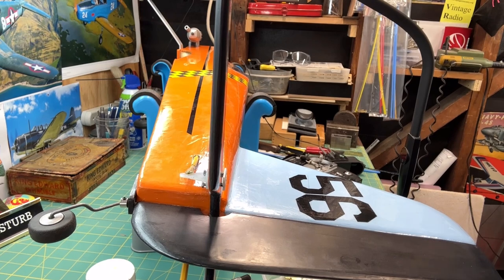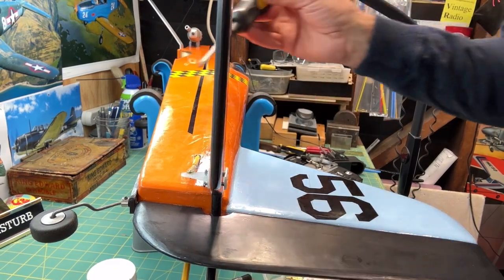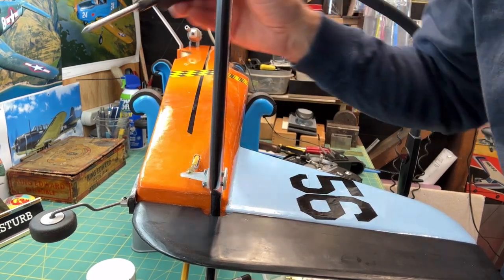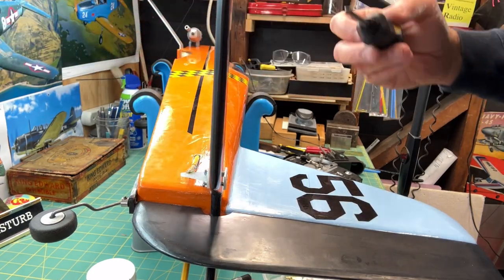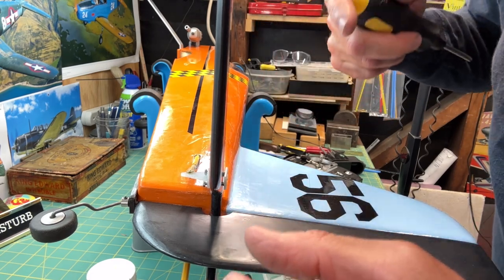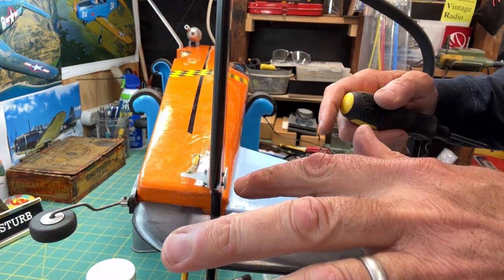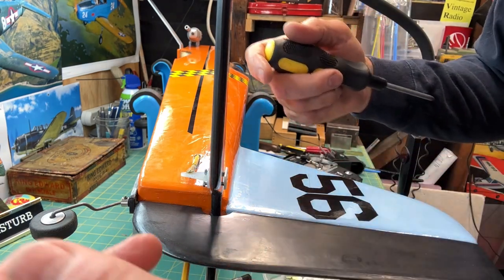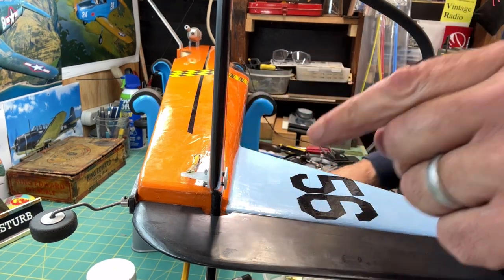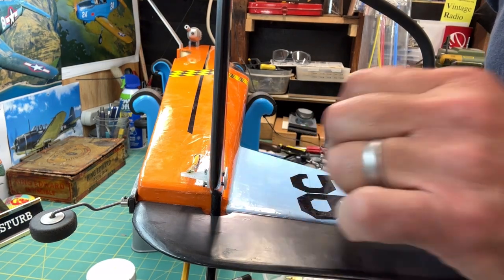All right, so obviously I adjusted my camera angle here, and I did have a little bit of trouble getting it to line up, because as I drilled out the two holes, I kind of just skirted the side of the dowel, and the dowel kicked the screw over. So when the bolts came out on this side, they were kicked a little bit closer to each other, and they weren't lining up on the little plate right here. That happens a lot if you don't drill those holes perfectly straight. When they pop out on the other side and they're not perpendicular, they don't line up with this retaining plate on the back here, and then you have to mess around with it.